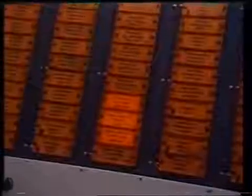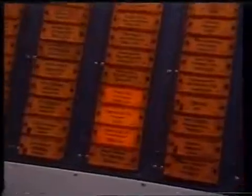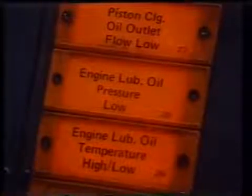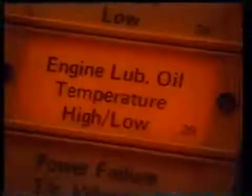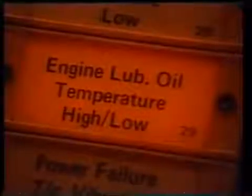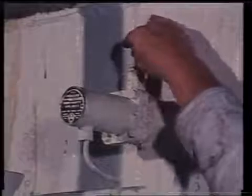If your ship is classified for unattended machinery space — a so-called UMS operation — the electrical survey will be extended to include all alarms, fire detection controls, and fail-safe installations. All alarms associated with the main engine, auxiliary machines, lubrication, and cooling are to be tested for correct function by operating the sensor switches by hand or simulating the switch action under the expected alarm conditions. The duplicate bilge level alarms must be proved to work to the satisfaction of the surveyor.